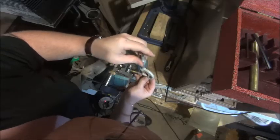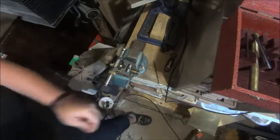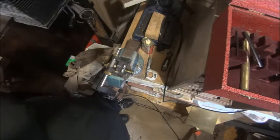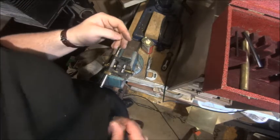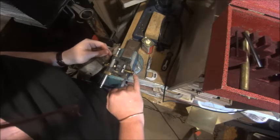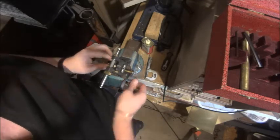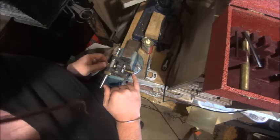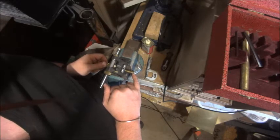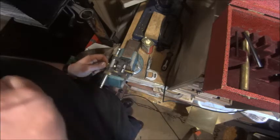And you want good light, which is something I haven't really got here. So we want it down to exactly halfway, which is 1.16mm - that's about where we want to be with it. I've been working on this for probably 20 to 30 minutes. I've got a nice parallel half-thickness flat on there with a good almost black polish - I haven't polished it off really. You can still see tiny marks and it wants to be pretty good.